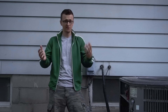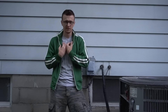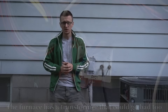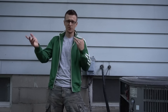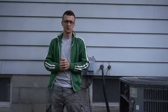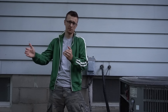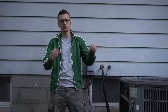Reason number ten is a bad transformer. Not many air conditioners have a transformer — at least not in Minnesota — but if your unit has one, it could be bad. To check it, ohm out the transformer and verify you get the right resistance readings. If you get OL or open line instead of a reading, the transformer is bad. If you have a burnt-out transformer, replace the contactor first, as the contactor may have been what caused the transformer to burn out. Replace both the contactor and the transformer and you should be good to go.